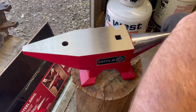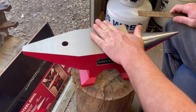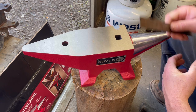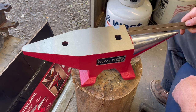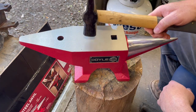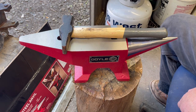This has a nice long face — four and a half inches across, which is a pretty decent face. Even larger anvils, you're typically not going to find a four and a half inch face on a 200-pound anvil — they might be four inches. The horn is seven and a quarter inches. These things are awesome at $150 out the door. Great anvil — if you get a chance, go pick one up.